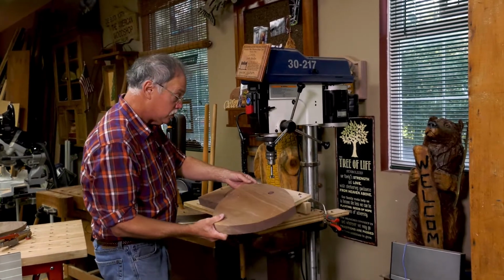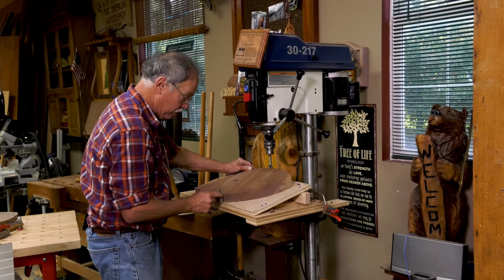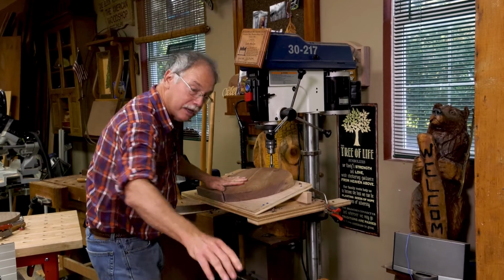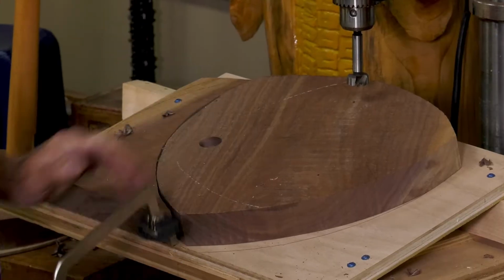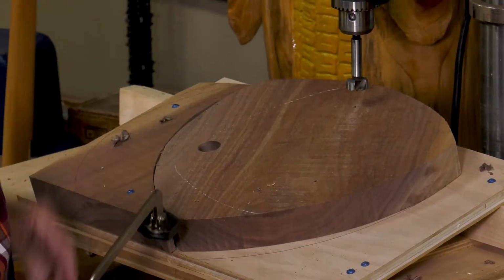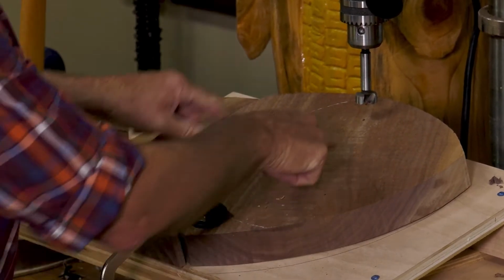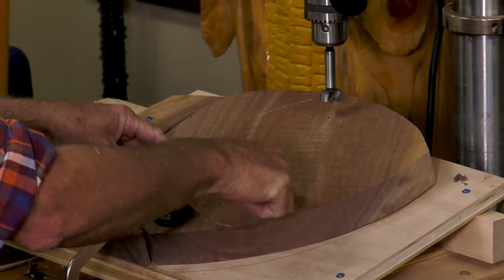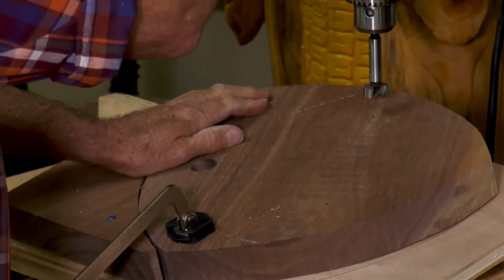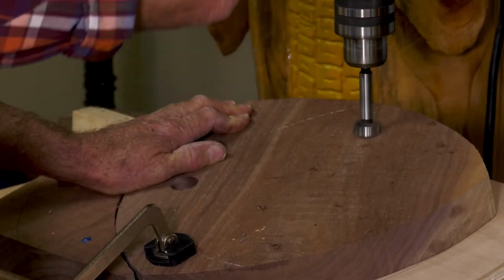And that hole is going to be 1.25 inches deep at the deepest spot, which would be on the downside of the angle. So with this curved fence right here, what I can do is rotate that around, line up this point right there, bring that point over to the edge of the fence and clamp it, and that will give me the precise angles that I need. And by the way, the center points of those 3 points, it's at the end of an equilateral triangle right here. That's 6 7/8 from point to point. And now I can finish drilling that. Be sure to clamp it and drill all 3 holes. From here, it's outside.